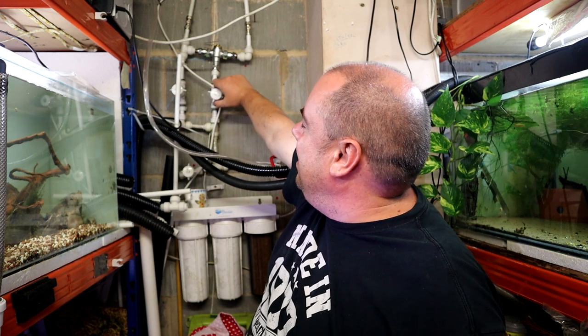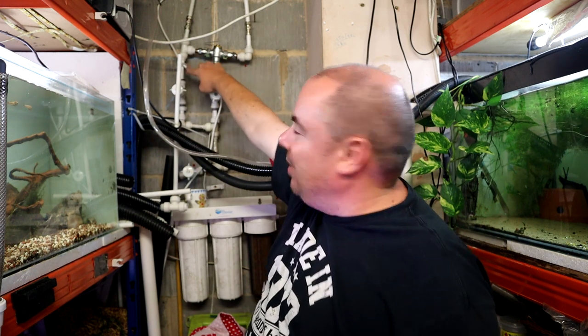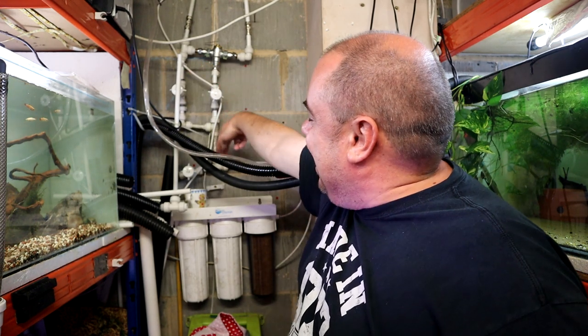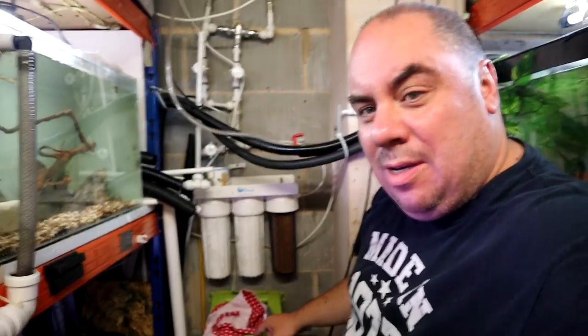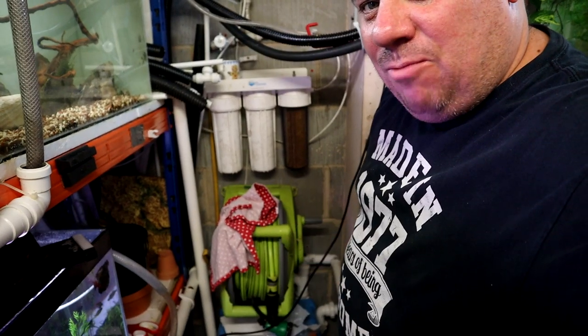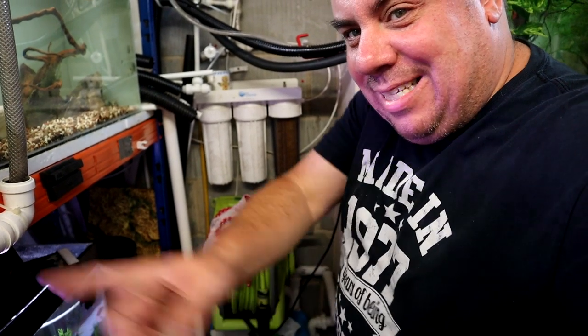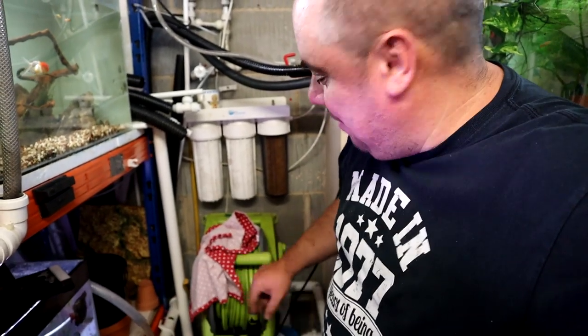I've got another tap in here so I can shut that off and just have pure cold, which is why we've got this little bit here. That then goes down into there. Again, another T-piece. The split here splits off one to a regular old garden hose if I just needed water for something. I used to have access out into the driveway there where we'd wash the dogs and stuff, so we would use that with nice warm water if need be.